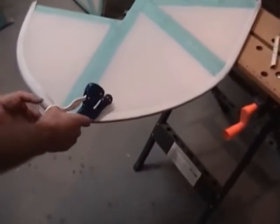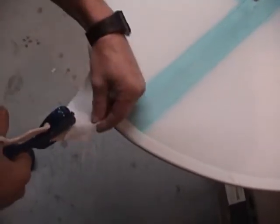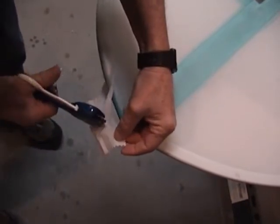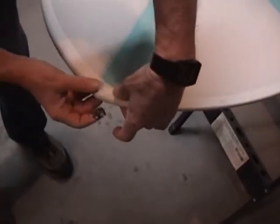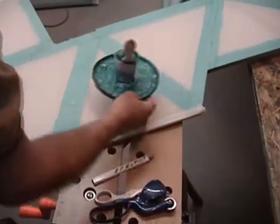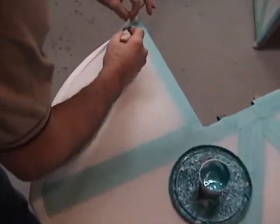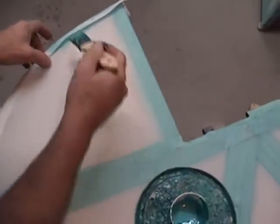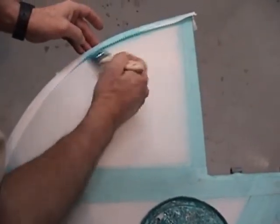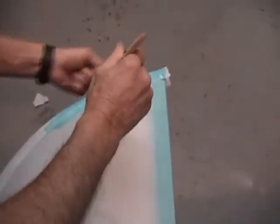We've got a pencil mark — not a big deal to pull it loose so we can get into here. We can go ahead and follow our pencil lines to make our cutout. The beauty of this is our glue's working for us. We can pull it loose without getting our hands messed up or working on wet glue. Look how nice that finish is — it flows right in. Now for the glue on this, it's the same procedure except we're going to lift the edge of the tape up and brush glue around here. We're not going to pre-mark it like we did before — just wipe some glue under there and brush it down through the tape, roughly to where our center line was.